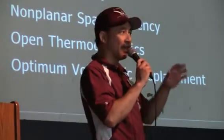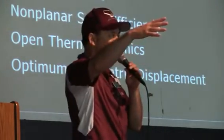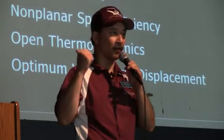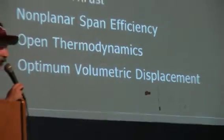It's extremely efficient. But instead of having something like that behind a body that doesn't seem to care about the inflow field, we need to make sure that the body is a natural laminar flow body and that we put the fan significantly behind the point of transition — and that we use good inflow designs so that we don't make that impeller fly in a terrible environment for making thrust.